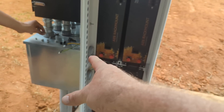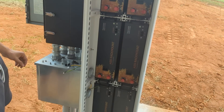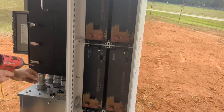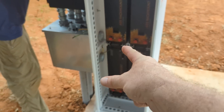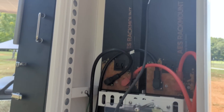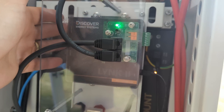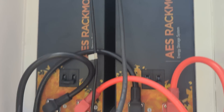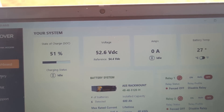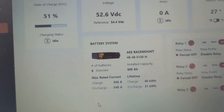I'm going to add the combiner on here — you put the batteries in, get them all grounded and ready to go, and then there's a nice combiner front with the Links relay controller that goes on top. We punched holes for the wiring trough. We just turned the batteries on using the Links communication gateway — all the lights are flashing, the batteries are talking to each other. Connecting via USB to a laptop shows state of charge, voltage, and six batteries detected — 600 amp-hours.